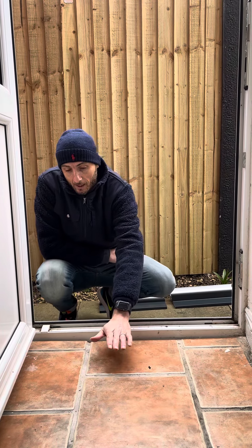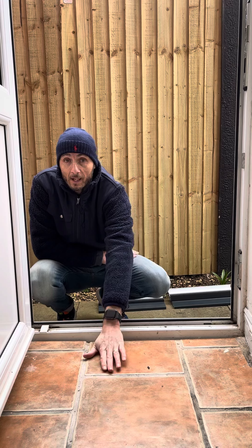This is a good example where we have a tiled floor finish on the inside that sits above the outside. What we need to ascertain is how high that is, so that what we take out isn't too big and we don't end up with a floor level on the inside that sits above the threshold.